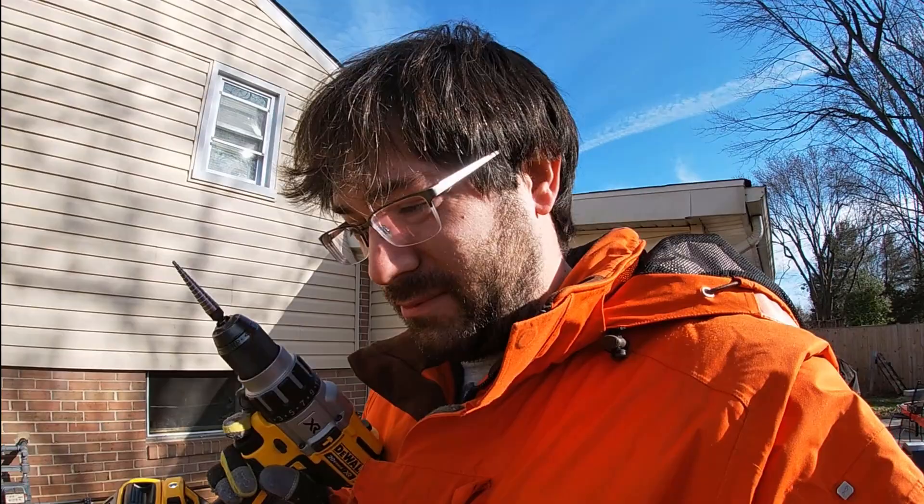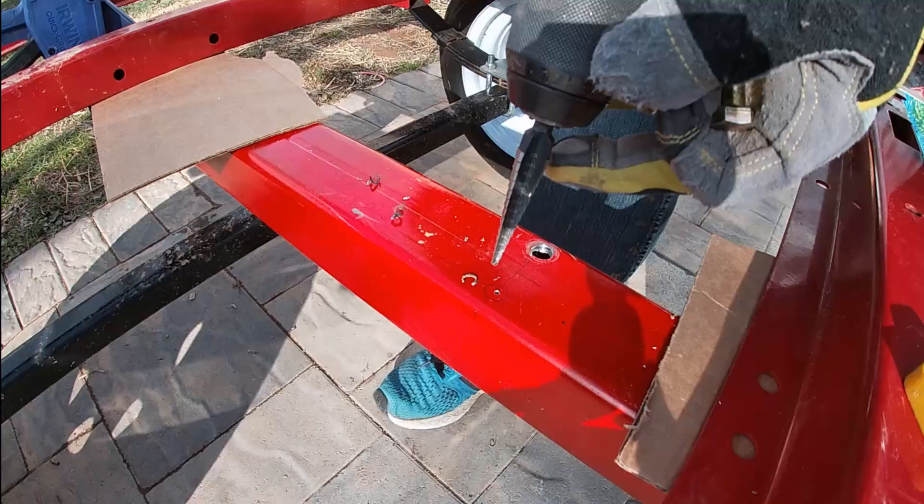I love this thing. That was like 20, 30 seconds tops. Of all the tools I've gotten for these projects — orbital grinders, a new cordless drill — this step drill bit just blows me away. It's so little, it's so simple, it was 20 bucks. That hole was miserable with the other drill set, and that was a decent set. If you're drilling something thin, get a step drill. They're amazing. 20 bucks.